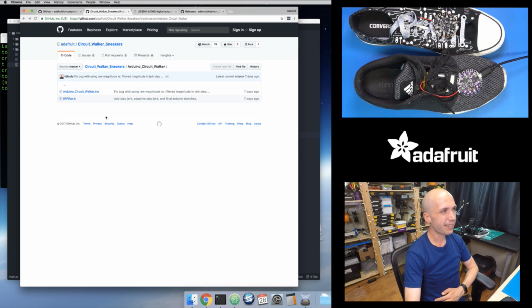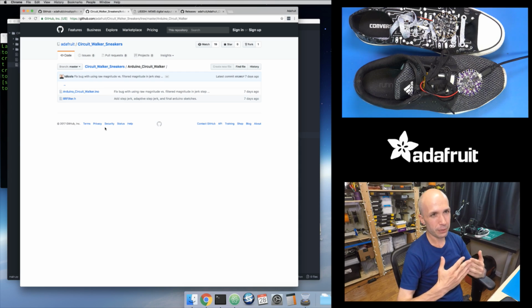So all of that adds up to tell me intuitively that I'm probably not going to be able to do that fast enough in CircuitPython, because not only do I need to do all those multiplications and operations, I also need to read my accelerometer data. So that's also some Python code that's going to need to run and get the accelerometer readings. And then I also need to light up the pixels, so do a frame of animation. And in that frame of animation, I'm using the sine function to compute a sine wave, and doing a lot of multiplications and things like that. So it's not just maybe 20, maybe 24 or so multiplications to do the filtering and math. It's all of that plus all of the operations to compute a frame of animation, plus all of the operations to read the accelerometer. So I had this intuitive sense that I'm probably not going to be able to do that fast enough with the CircuitPython code.